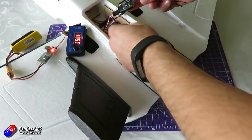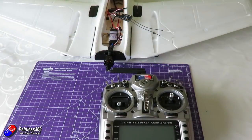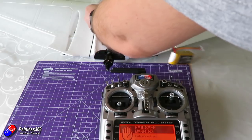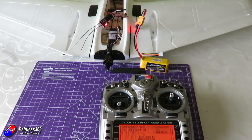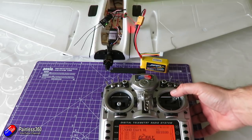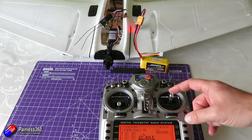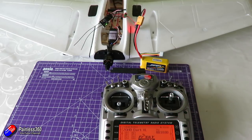I don't plug the ESC in initially - if we do plug it in, it'll go into channel 1. I'm not going to do that right now because I don't want to accidentally start the motor. Make sure the props are off for this. I'll power the receiver using a 5-volt battery eliminator circuit plugged into one of the spare outputs on the receiver. Once everything is connected you can move the controls and see the servos - but you'll probably find they're not moving the right way, so we need to work through and change the direction in the mixes. Don't worry, it sounds complicated but it's actually really straightforward.